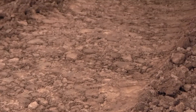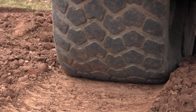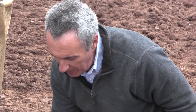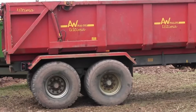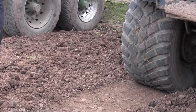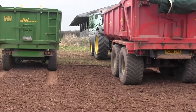We've got tires here that are inflated for field conditions — down to one bar. Down the road at high speed you'd likely have to consider putting them to slightly higher pressure, hence the middle example. With the right tire and settings you can minimize the effect, and as importantly you minimize any corrective action you'd have to take and the cost of that. These same tires inflated to three and a half bar represent the capability to travel down the road at 60 kilometres per hour.